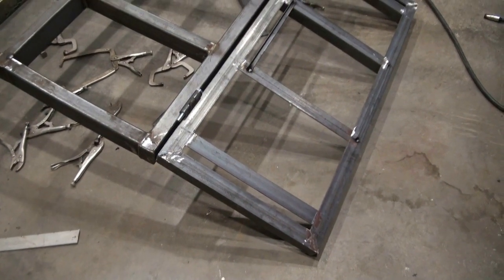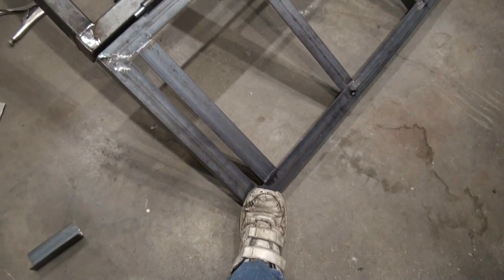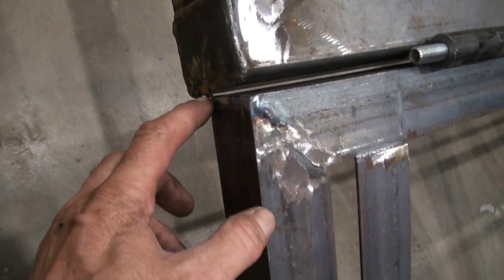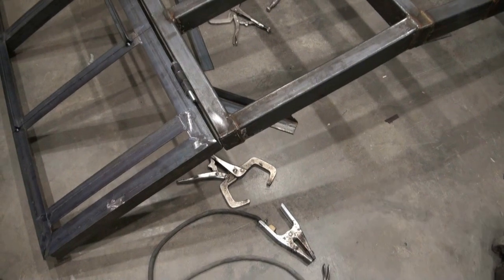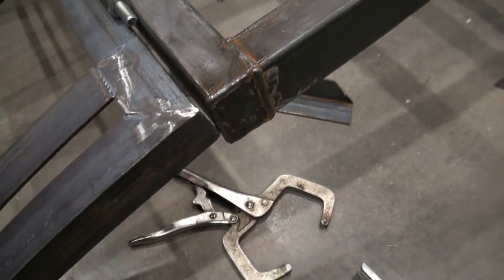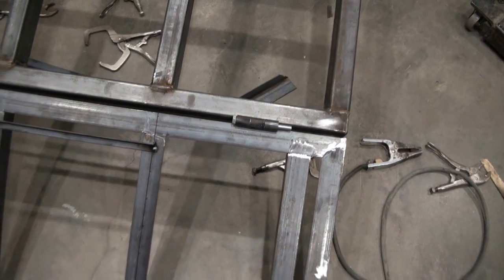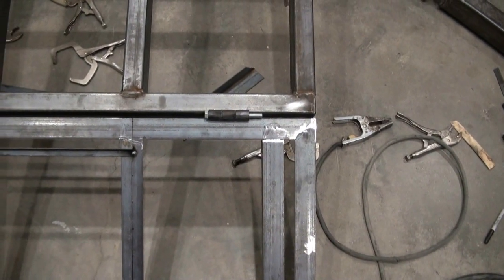It's close, but I'd like to make some changes. One problem is the ramp is actually not touching the ground — it's interfering. There's some weld interfering right here. I could grind the weld off, but I don't think that's still going to be adequate — if the trailer is on uneven terrain it may still not be enough. I can see it on this side as well, a bit of weld contacting right there. I also think I'd like to move the hinges inward, because where the hinge is now it may be interfering with what I want to load onto the trailer.